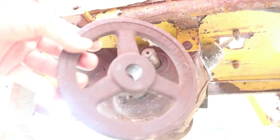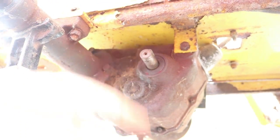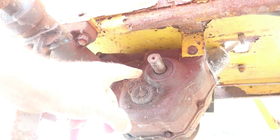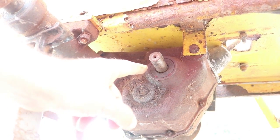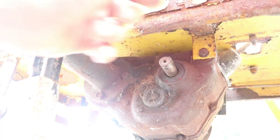Under the tractor, I already pulled the original V-belt pulley off of the driven shaft in the transmission. That's three-quarter inch, so I should be able to slide a three-quarter inch bore sprocket on there, cut a hole going up, and run a chain from this sprocket up to that jack shaft.